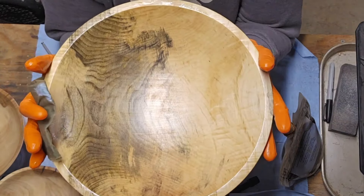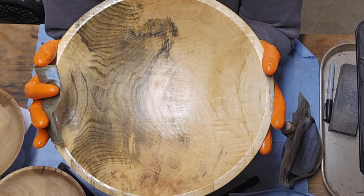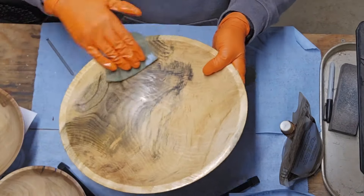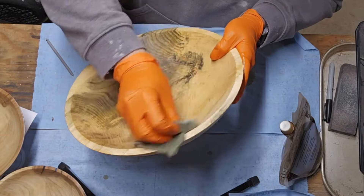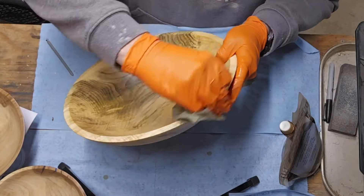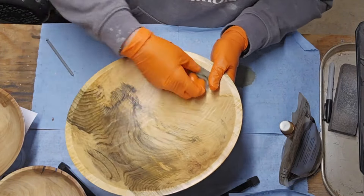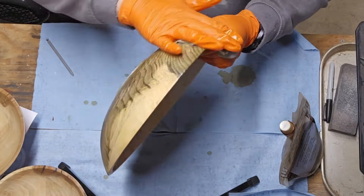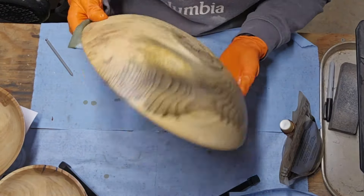So on this Waterlox, what I do is I put a generous amount on my first coat and let that soak in — which you can see is almost completely soaked in. I just keep rubbing it, because this is the first coat, it's your base coat, so I just want to make sure it's all rubbed in really nicely with no runs or anything. If there's any excess, I'll wipe that off in about 10 minutes. We'll get this all rubbed in and soaked into the wood, and I'll bring you back when it's all polished up.